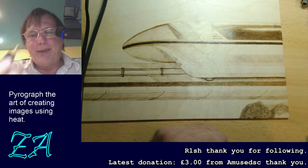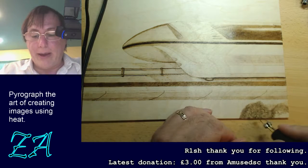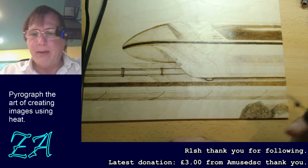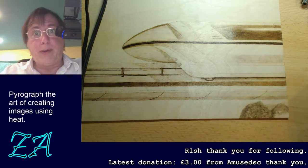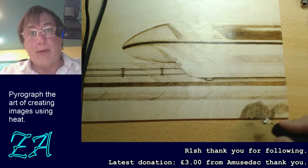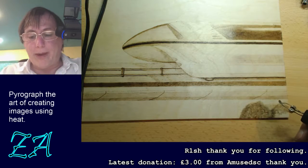So that's one of the typical mistakes you make, and there's a couple of ways around fixing that. One is to simply take this and blow on it, which will cool it down enough so that when I touch it down, I don't get that brown mark because it's cool and will warm up. I could keep a scrap bit of wood to one side to do exactly the same thing. Put it down on there, which will cool it down enough so that when I put it on the workpiece, it doesn't create the dark mark. And then I can just carry on with the pen.